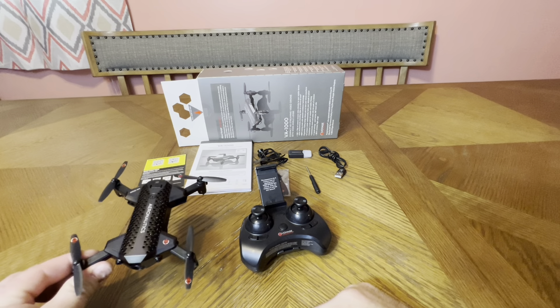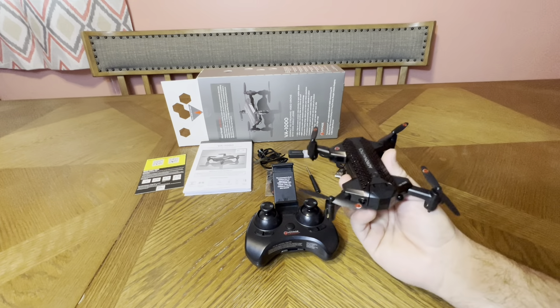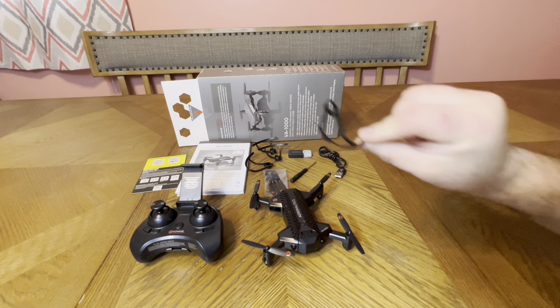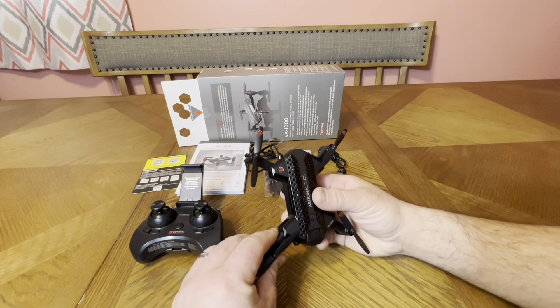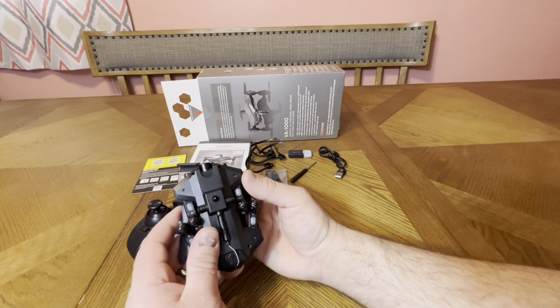You'd need a soldering gun, some extra wire, and a connector — it could be JST 2.0 or those white little micro connectors. Also, you can reach out to the company to buy more batteries or find a similar Chinese-brand drone battery. The drone does fold — this is how it folds: one arm first, then this one, then those. It makes a smaller footprint, a little more subcompact — you can slide it in your pocket. Pretty rigid, not bad at all.